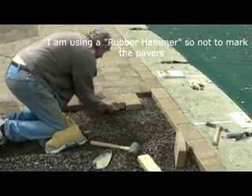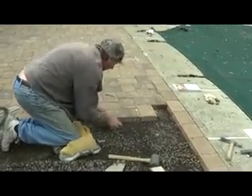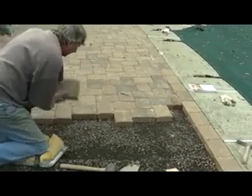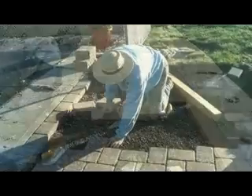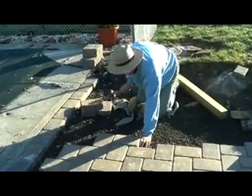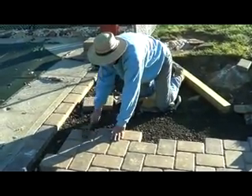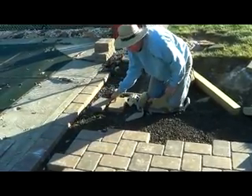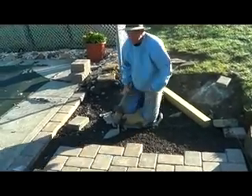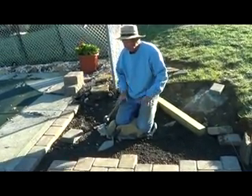Just tap them down a little bit and they're all laying flat. With gravel you don't have to use tampers, no machines or anything — just put them right on top of the gravel. Gravel basically packs itself. The point I'm trying to make is masonry work is not black and white; there's always some color to it. There are different reasons for certain masons to do it a different way. Usually I put them on concrete, but it all depends on the job. This one I want the water to go through it and get away from it, and gravel is a good base.